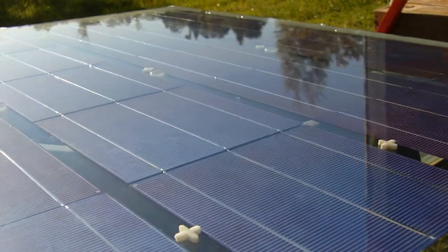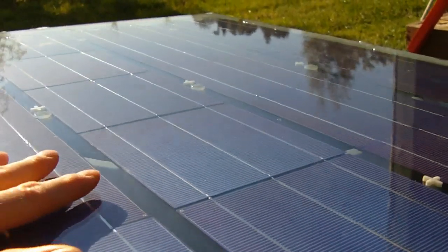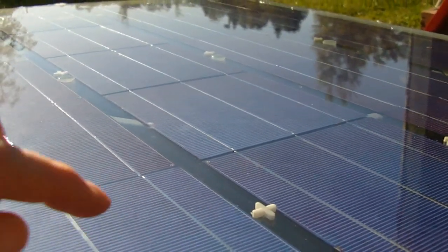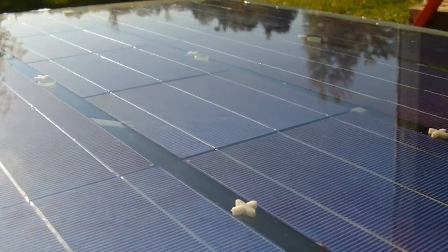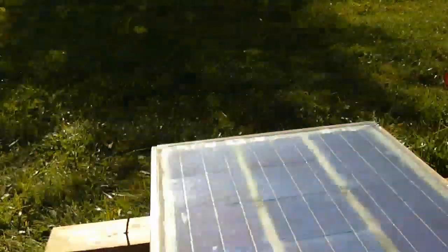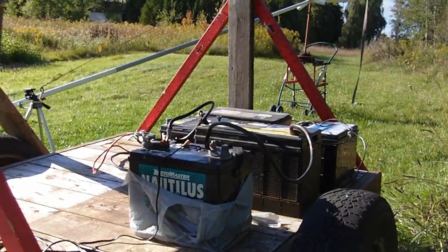If you calculate up your rows at 2.5 volts, at 4 watts each, you'd have 32 amps. Now these aren't going to produce 4 watts — that's a maximum, so it'll be less. You're better off using your homemade solar panels for charging batteries and then using inverters to power lights and whatever.